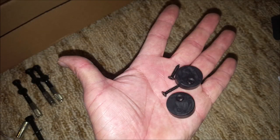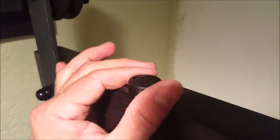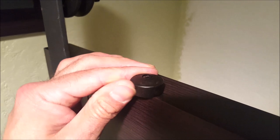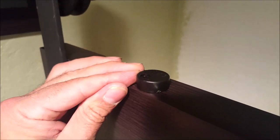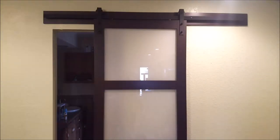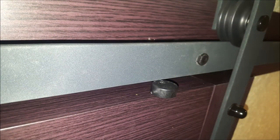We're just about ready to hang the door, but we've got to do a couple more things first. These are rubber stops that go on the top of the door, and what these do is lock that door in place so it can't hop off the track. They're very simple to install — they just screw to the edge of the door. If you pivot them towards the inside of the door, that locks it in place so it can't hop off the track. If you want to take it off the track in the future, you can just pivot these outward and then take it off. To hang the door on the track, all we've got to do is get those wheels on top of the track, then pivot those rubber stops to the inside of the door to lock it in place.